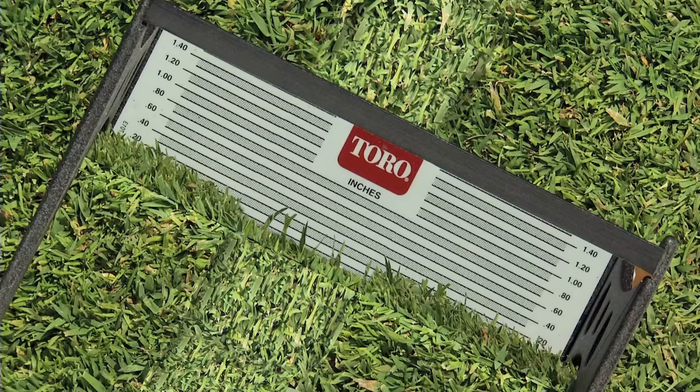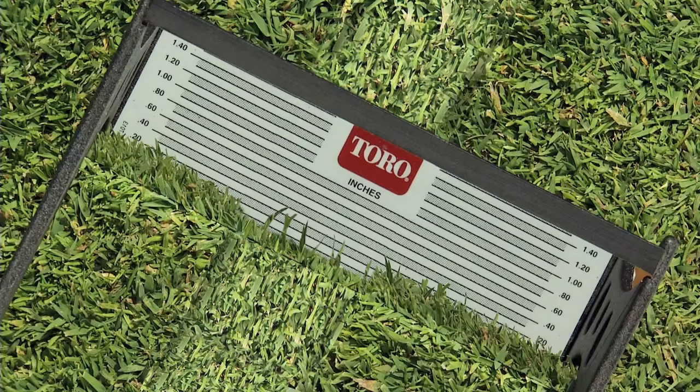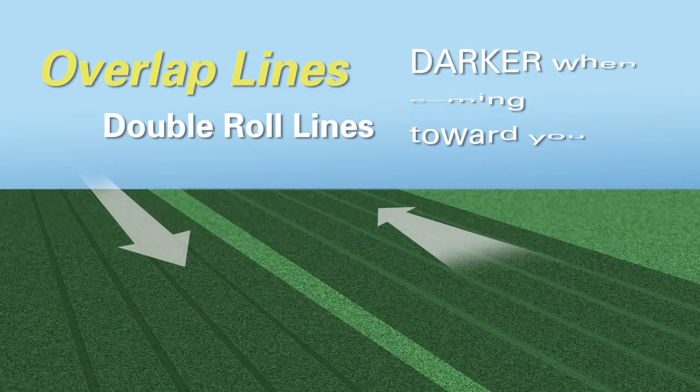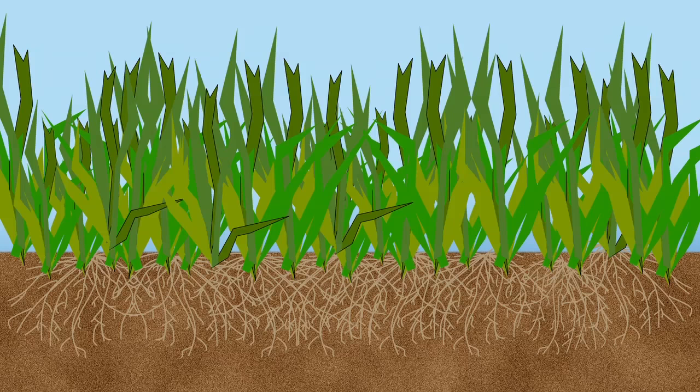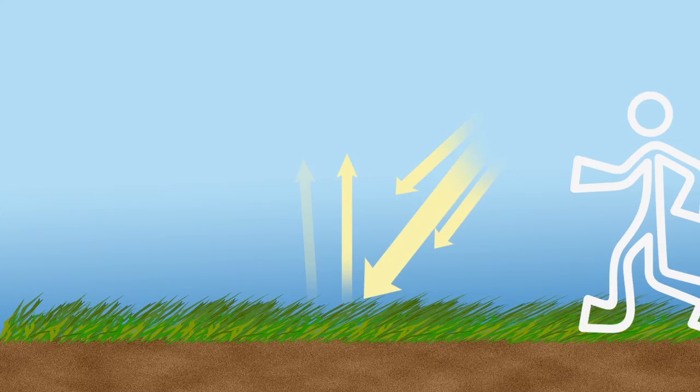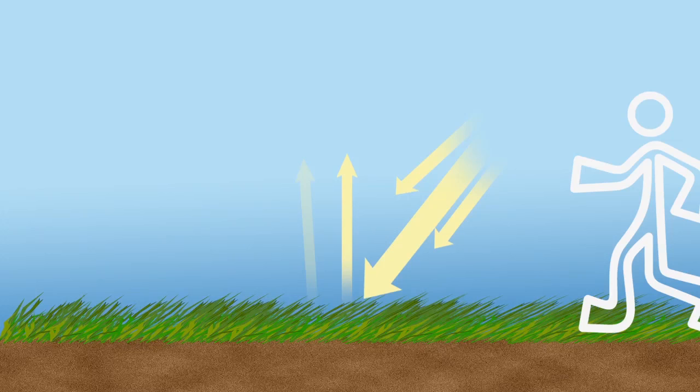The second type is double roll lines, where the overlap area is rolled both by the front and rear cutting units. In the double rolled areas, the grass blades will be compressed more than the surrounding turf, so the lines will appear lighter in away passes. But how do you distinguish double cut from double roll? The key identifier of double roll lines is that they will appear darker when viewing passes coming toward you. The double rolled blades of grass are laying flatter, so when viewing away passes, they reflect more light to your eyes; when viewing from the other direction, the lines appear darker because the grass laying toward you captures more light. Make sure you're viewing mower passes in both directions when diagnosing what type of lines you're seeing.